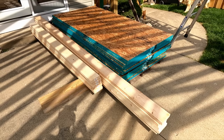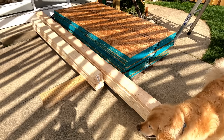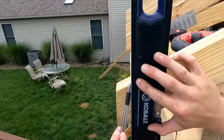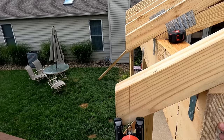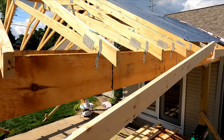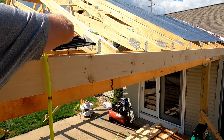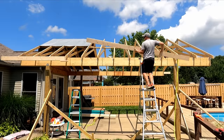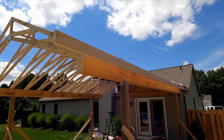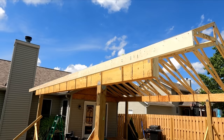After picking up more lumber I'm using two by sixes to create the rough fascia boards, but first I had to go back and cut the truss overhangs to length. I ordered the trusses a little long because I had a feeling I wouldn't be able to install them perfectly or they wouldn't all come 100% identical — and I'm glad I did. I marked them and cut them with a jigsaw, which got a good enough cut to get them all straight. Then I came back and nailed them in with a framing nailer, about two nails per truss. I left the boards overhanging the ends so I could use them to build overhangs on the gable ends later.